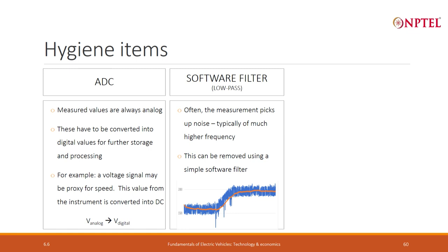The raw signal coming from the sensor is shown as the blue line — every instant it is giving a different value. The actual signal is around 1500 but the value I am getting is fluctuating wildly within a plus or minus 100 range. The speed then increases to 2000 RPM; all along the way the noise persists. The noise is not even dependent on the level — whether at lower or higher speed, the noise is roughly the same. When I apply a filter, what I get is the brown line, which is very clean and smooth; that is what I take for further processing in the controller.